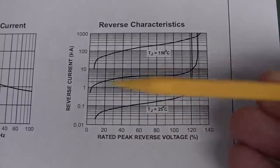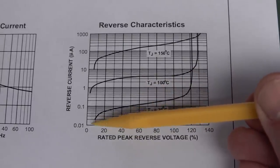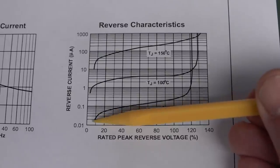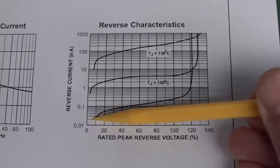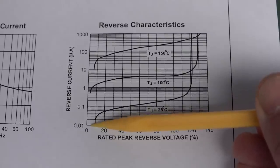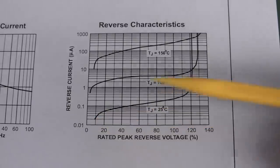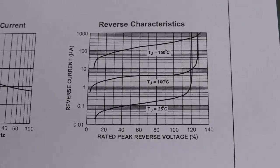We're not operating at maximum rated voltage or temperature. They've got three different characteristic curves at different temperatures. We're at ambient temperature and only operating at basically 3 volts — two AA batteries, 3 volts tops. So at 10 volts we're already down at 20 nanoamps on this graph. It just drops off a cliff. It's about 10 nanoamps down here at 5 volts — less than that at 3 volts. This is why we weren't able to measure anything on our BM786.